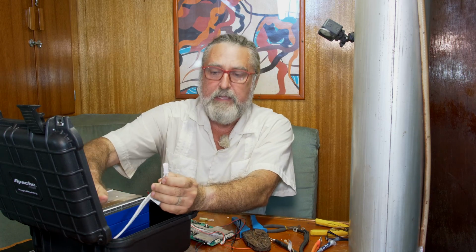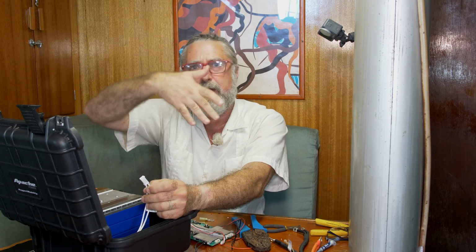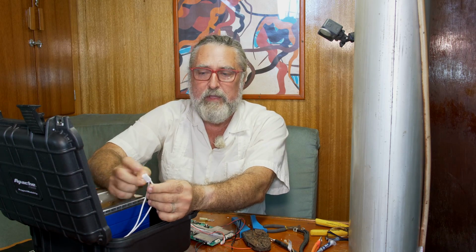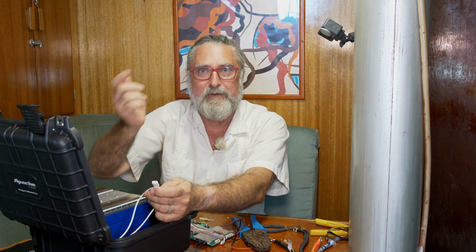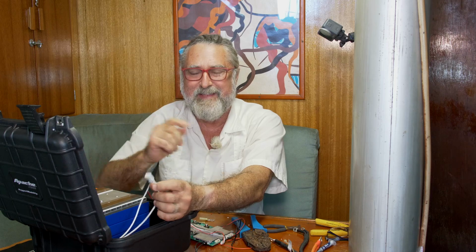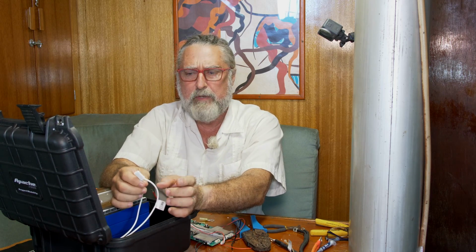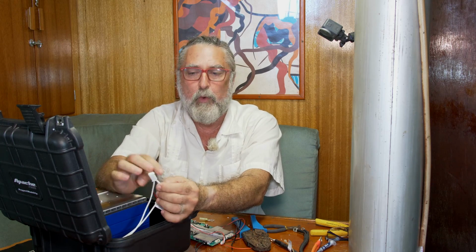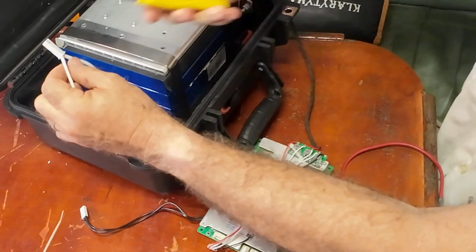This is that thermal blanket. All that is a trace of copper on a piece of plastic that's impervious to heat, and it's just a resistor. So if we apply power current through that resistor, it'll make heat. Back to Ohm's law, got a whole series of videos on that. If you're interested in how electricity works, that's a great place to start. Now, being that it's just a resistor, it doesn't matter what direction we put the power. So we're going to open one of these wires up,